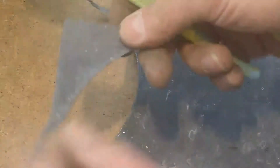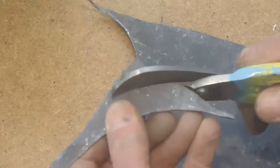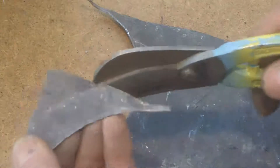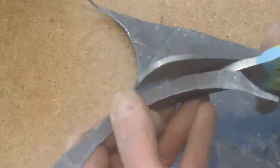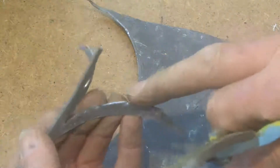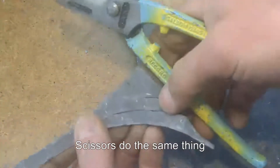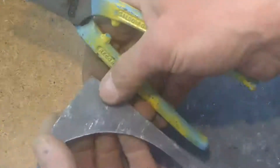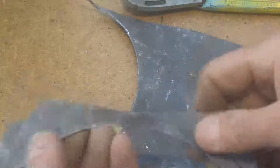That's my disc. Here's a tip for you: when you're cutting like that, I never closed the cutters completely. If you go snip-snip-snip, what you wind up with is a ragged edge. It's the same if you're cutting paper or fabric or anything. As a kid I built radio chassis, but I've employed fitters and you'll see them doing this — you just know it's wrong because then you've got to file that off. Another wrinkle for you.